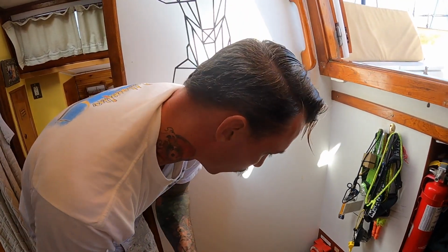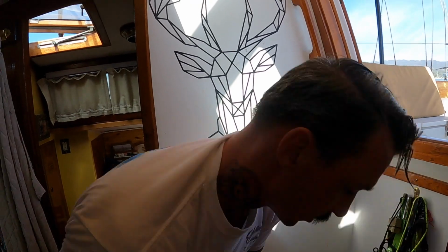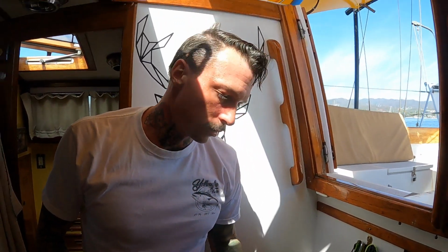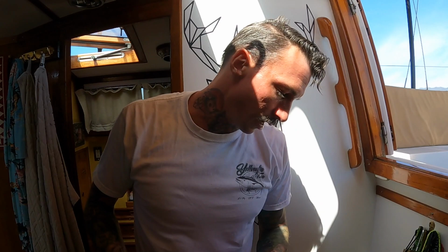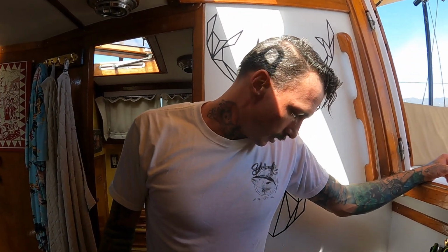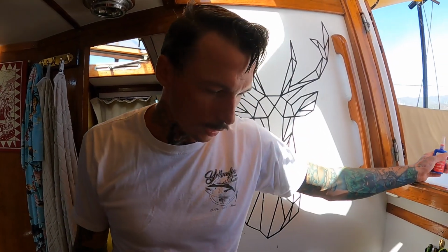I'm also not a fan of wing nuts for battery applications, but I put a bit of red thread locker on the thread. Wing nuts have a tendency, when things vibrate, like when the engine's running, to kind of loosen up because they're meant to be hand tight. I did tighten them a bit with a wrench, so should be good with Loctite. Sometimes you gotta do the best you can with what you have, and that's right now. We'll call that a win for now.